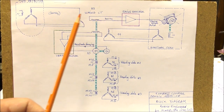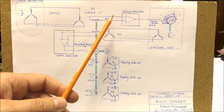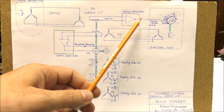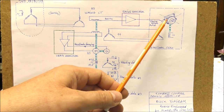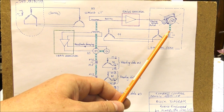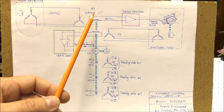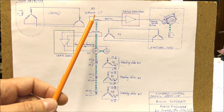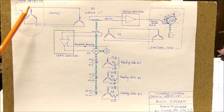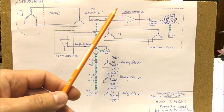The difference between a classic amplifier and this slaving amplifier is that at the input of the slaving amplifier we have a signal at 800 Hz, and at the output we have a signal at 400 Hz. The output signal is fed to the torque motor of the gyro in order to modify the heading. So the change of the heading of the gyro is reported to the main shaft, which permits to reduce the error voltage on the rotor of the control transformer until this voltage is null. In that case, the heading of the gyro is identical to the heading of the flux detector — the gyro is slaved to the flux detector. This is why it is called a slaving amplifier.